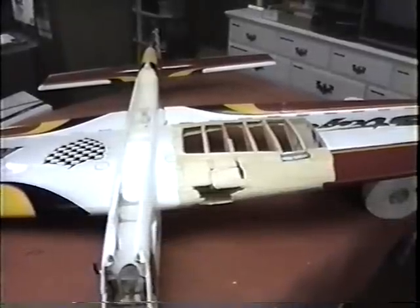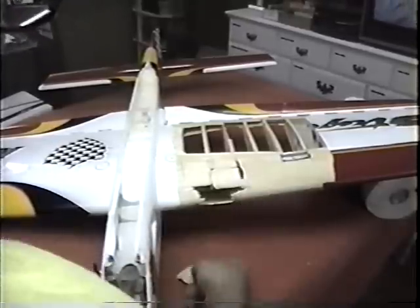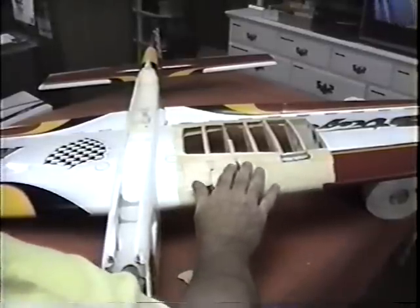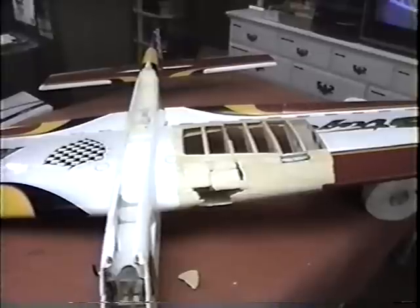If we had the pieces, and needless to say, I've looked around and we don't. I've looked for, I don't know, I'm sure this goes somewhere, but by the time I figure out where it goes, I probably could make a piece. And in here, I'm just going to back cut it like a cork and put pieces in that are bigger than these have to be. And then when I get to do the cosmetic part tomorrow, I'll block sand this all down, and if I have to, I'll replace all the cap strips with bigger cap strips, 1/8 inch, and then block sand them in. Again, I'll look at the cosmetic part of it. What I really want to get right is all the structure.